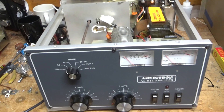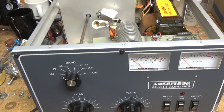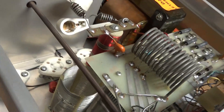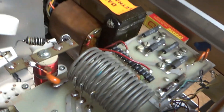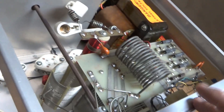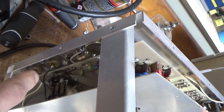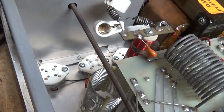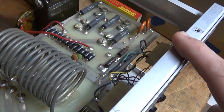readyamprepairguy.com, 203-892-4119, also harbachelectronics.com. Please like, share, and subscribe. So we have another Ameritron AL811 — it's an older one. I'm going to replace the plate choke with the newer style, put a parasitic board in, do the bias mod, add the diodes on the rear board which set the static plate current. Getting a brand new matched trio of 572B tubes from Pentalabs.